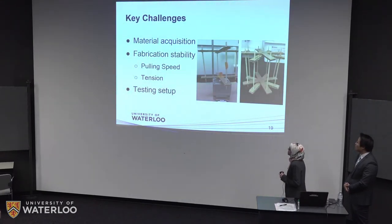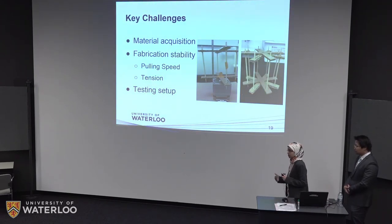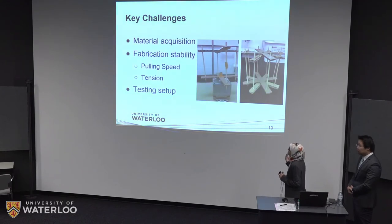As for the challenges we faced over the project, first was material acquisition. We had difficulty obtaining the nylon fiber with the required 50-micron diameter, as well as the motor. For fabrication, the first issue was that the motor we ordered only had the speeds reported in literature. Once we scaled up production to the setup shown earlier, we discovered those speeds were relatively slow and we needed much higher speeds. The solution was a drum we made to attach to the motor shaft — a drum with a bigger diameter than the motor shaft — which increased the pulling speed.